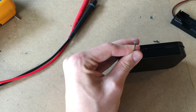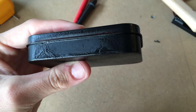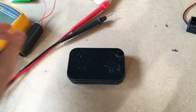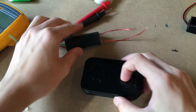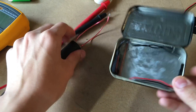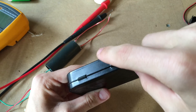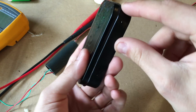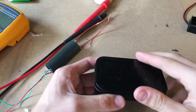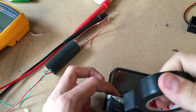Place the nail and poke the hole. Now go ahead and repeat the process on the front. Before we place this stun module inside the Altoids tin, we're going to need to run the wires through the holes and insulate the outer edge. What we don't want is the wire arcing through the paint into the case and going around to the other wire — we want it going through the person's hand. So we are going to wrap this outside rim with some electrical tape.